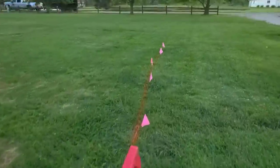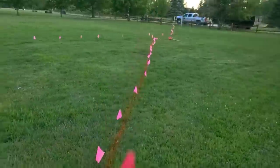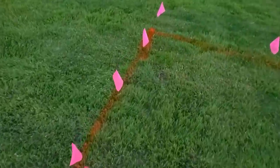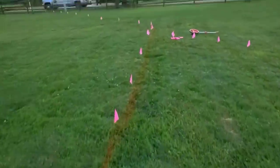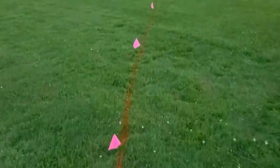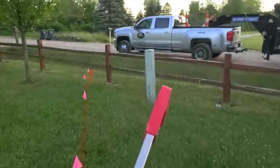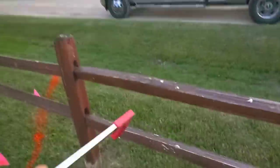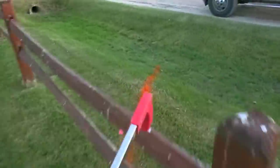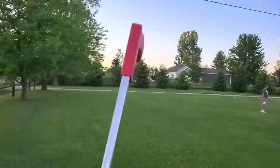We're going to have a big six inch system. You can see there's cross T's, some T's, and this is a triangle section — this is how this design came together. I walked with the homeowner and we flagged it together. What's nice about using flags opposed to paint is when you're trying to connect all the dots you can move the flags to where they make sense, which makes the job that much easier.